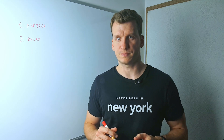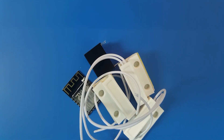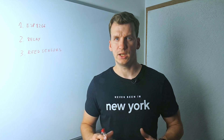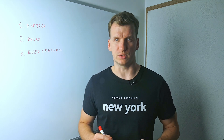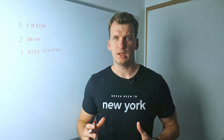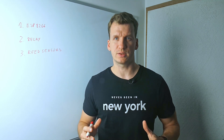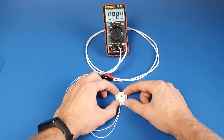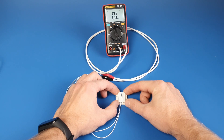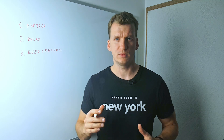Magnetic reed sensors. Unfortunately, the same connector is used for both opening and closing, which means we don't really know the current position of the door. If it's closed, shorting the pins will open it, and vice versa. That's why we need some feedback — in other words, we need reed sensors. It has two parts: the sensor itself and the magnet. When the magnet is near the sensor, the circuit is closed; when we remove it, the circuit will open. In this project we will use two of them to detect when the gate is fully open and fully closed.